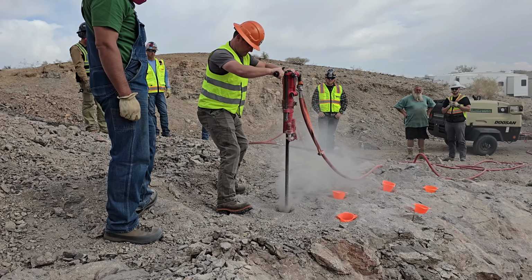Holy smoke. Remember I was telling you about ANFO having lots of gas pressure? It does. All right, we're going to see if we can find our tattletale. I have a suspicion they all went. There's one cap. It was up over here. We are shot. Yeah, maybe too much ANFO in those holes. But the rock has been pulverized and it went that way real far. So, lesson in overloading holes with ANFO learned.